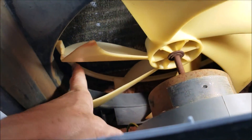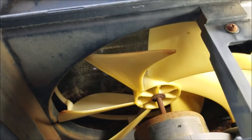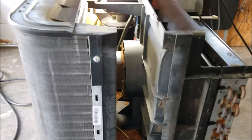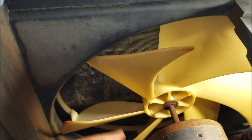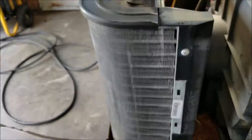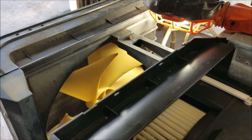See down in here — you got your fan, but you also got this ring around the fan, that's a pickup ring. It picks up water and throws it on the surface of the coil, which helps it cool and helps get the heat out — makes it more efficient. A lot of times you'll see these window units hanging out the back with a real steep tilt. They shouldn't be that way — you might have a slight tilt, but a lot of manuals want them to be level or maybe just a hair tilt. Not very much. Because you do want water to stand in there, as that makes it more efficient. Don't think you're doing it any favors by putting a real steep angle on it, because you're not. Finish straightening up the fins a little bit and start putting the cabinet back on.